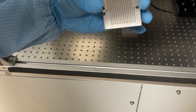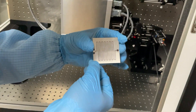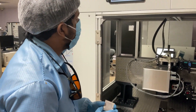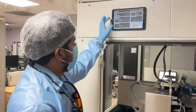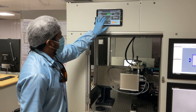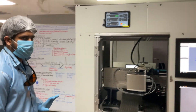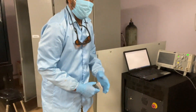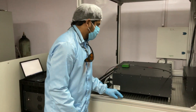This sample has already been machined — this is the micro channel we have fabricated. It may have a depth of less than 100 micrometers; if we want more depth, we can move the stage upward and repeat. After machining, we stop the laser by switching off the final amplifier, wait for some time, then switch off the pre-amplifier. The oscillator inside the laser remains on at all times — we don't need to switch it off. That's all, thank you.